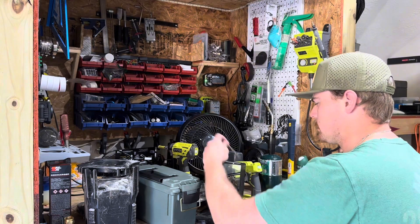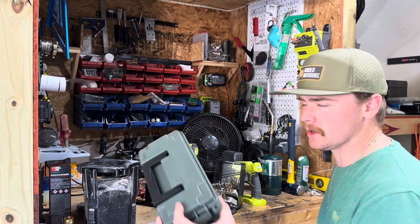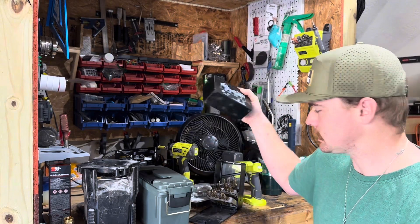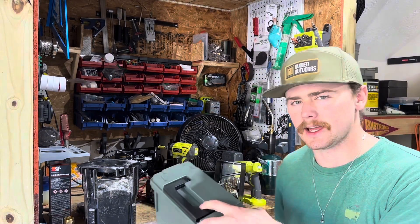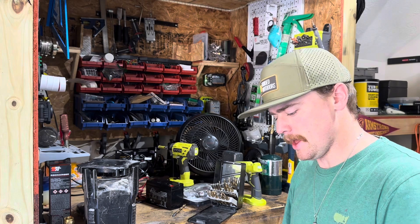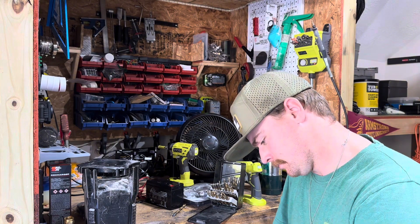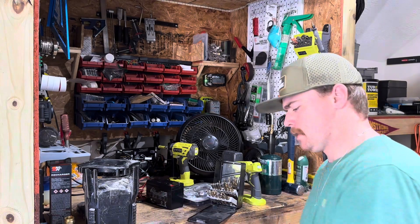It's fairly hard plastic - some boxes are harder, some are softer. You're gonna need an ammo box obviously, you're gonna need the cable, and I use 7 amp-hour batteries - they seem to work well. You can go bigger if you want, but it's not necessary. This one is lead acid, but the best are the lithiums. Most of mine have lithiums in them now - I'll be linking those in the description. They're like 20-30 bucks on Amazon and they work really well, especially in cold weather. We've got a pilot hole - now we're going to make it bigger.